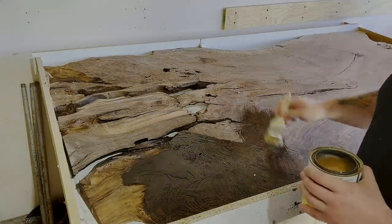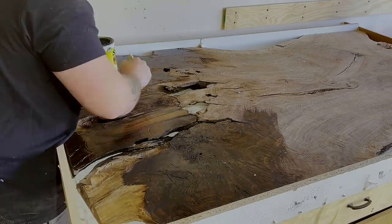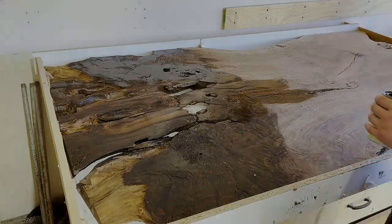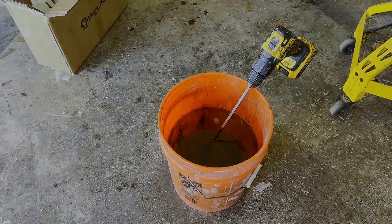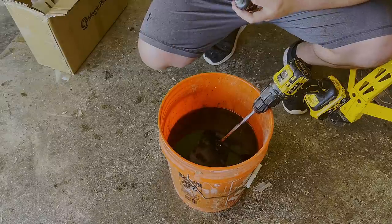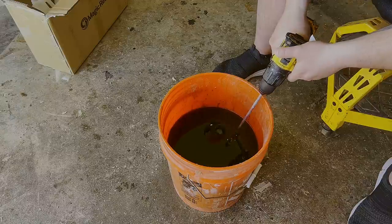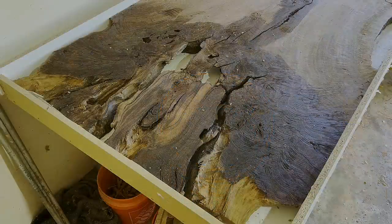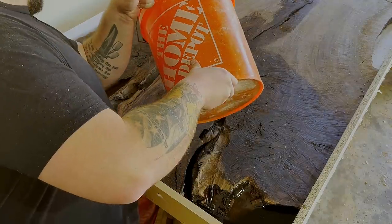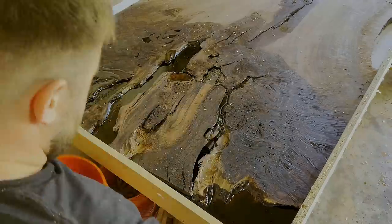Like always before any pour, I'm going to coat the sections I think are at risk of staining. When it comes to measuring colorant for my epoxy, I don't really measure it. I have a little metal stir stick in there, and the way I measure if my epoxy is black enough is I pull that stir stick to the surface. If I can see the metal before it breaks the surface, it's still not dark enough. I just keep adding more dye until I can no longer see that stir stick before it comes up above the surface.